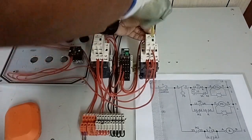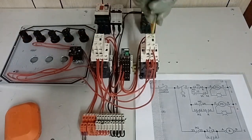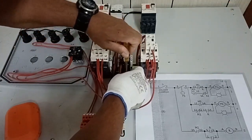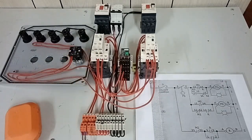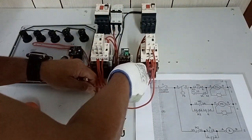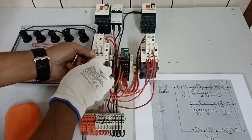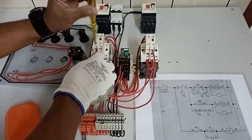From the other side of the normally closed contact on M2 contactor, this goes to our relay — to the common terminal of our relay. From this point, we will have a jumper or bridging going to the normally open contact of M1. I place the bridging — this is the wire, and they connect like this. This wire goes to the normally open contact of M1. I also place this wire on the auxiliary contact block normally open contact of our M1 contactor.